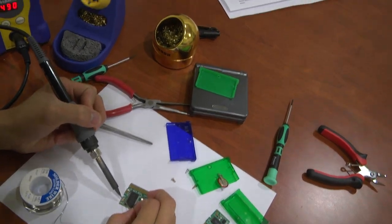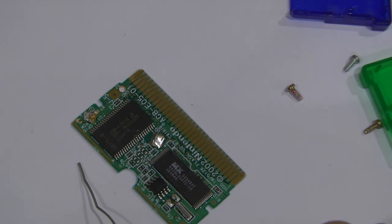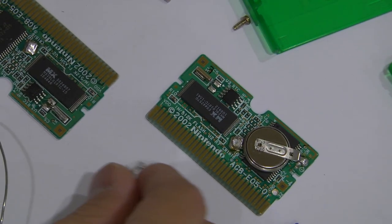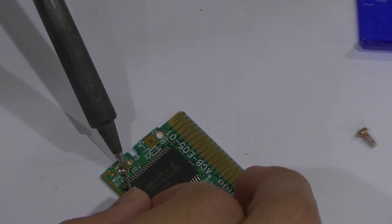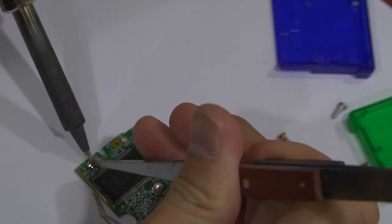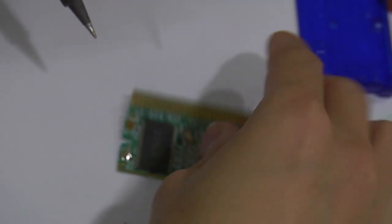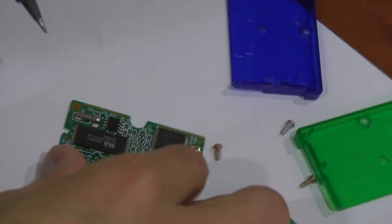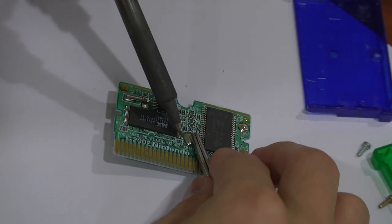This is the first terminal of the battery. We also didn't mark polarity notation, but since we have our other Game Boy cartridge here, we just follow the polarity on that. So this step we're going to remove the excess junk off the board and apply a new clean solder. I should be able to pull this tab right here — there was no tab on this one. This one has a tab so we'll pull this one off.